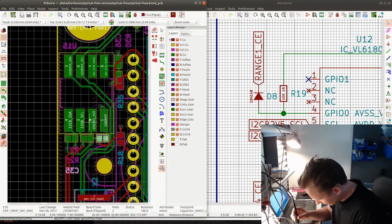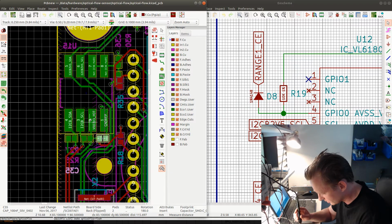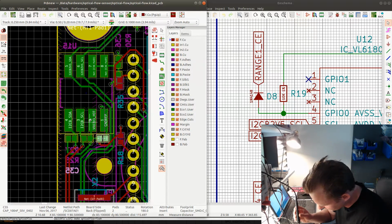Oops. So I'm soldering it to the jump wires that are already in place, and I must make sure that I don't overheat the jump wires that are already connecting across this voltage conversion chip, which used to be there. I removed the voltage conversion chip, so it's not there anymore, but the idea was to place it there.